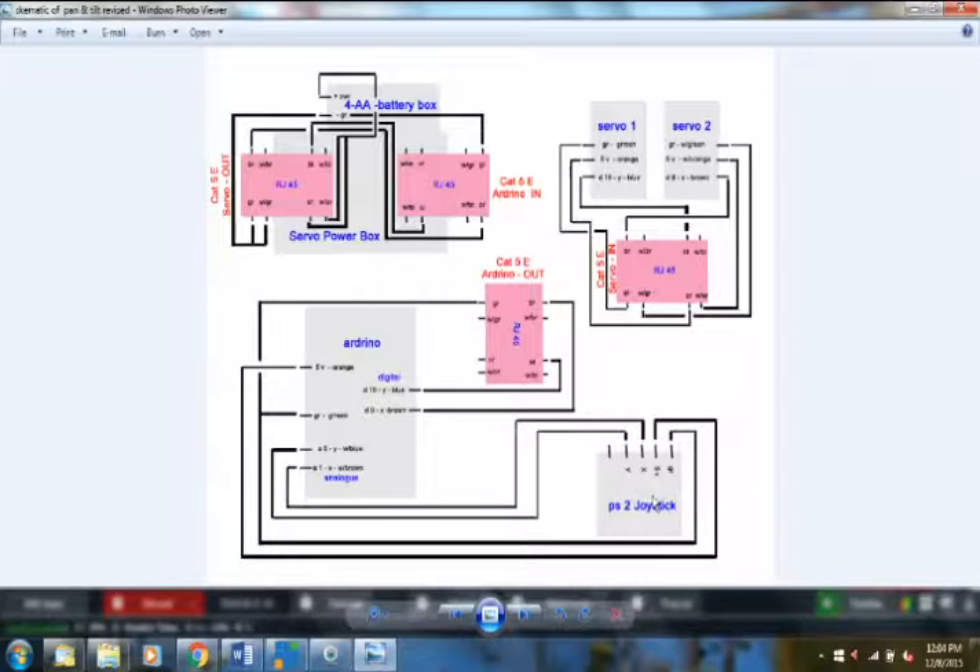From the PlayStation 2 joystick, the card itself will have ground, 5V, X, Y, and SW (switch) indicated. I didn't use the switch. It's a five-pin joystick — some have six pins, but the one I'm using is five. The ground is always the green wire in this project; the green wire carries ground throughout the cat5 cable.